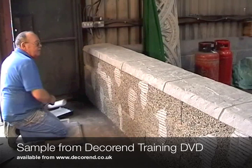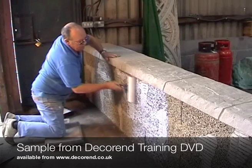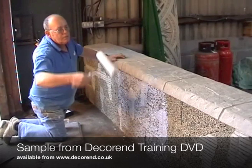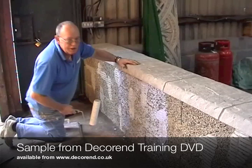This is going to be put on with a roller. I'm just going to roll it all over the wall. It's a good idea if you're doing big areas — this really isn't a very big area — to work in manageable sections of the wall, then move on, bond it again, then lay it on and stamp it and move your way down the wall. Because if this dries, you really need to put another coat on this part — it's a waste of material — so just work two areas that you can cope with at the same time.